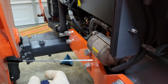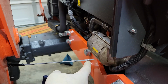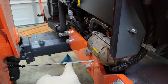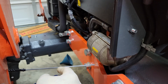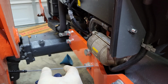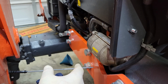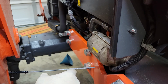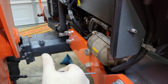So when I got the tractor, I asked the dealer, I said, so tell me where's the correct oil level on this thing? I said, because it certainly can't be right here, because the engine would basically be out of oil. And it can't be right here because now it's going to have way too much oil in it, right? They couldn't give me an answer. They couldn't say, oh yeah, it's supposed to be right here or there or there. So what I did is I drained the oil out. The first time I did the oil change, the book said it took 7.89 quarts or something like that, which to me, you throw in the amount that's in the oil filter and you're at 8 quarts. It's clearly if they're giving you a range like this, if I'm a quarter inch higher than that, it's not going to be the end of the world.